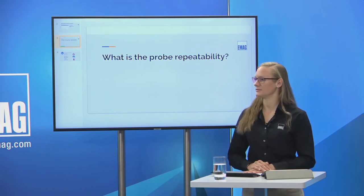Question: what is the probe repeatability? Probe repeatability is two to three microns in nominal applications. A shorter probe tightens this but limits reach; a longer probe opens it up slightly. We typically operate in the range of plus or minus double-digit microns. You do lose a couple of microns in probe repeatability, but for a true CPK setup everything goes to the CMM room for proper inspection. For tolerances around plus or minus 10 microns and greater, the probe is certainly adequate.